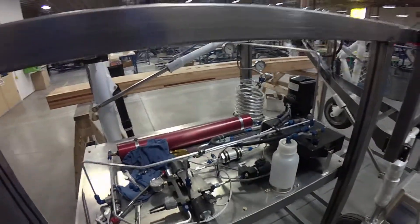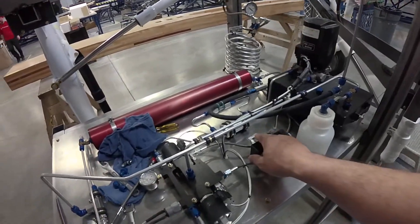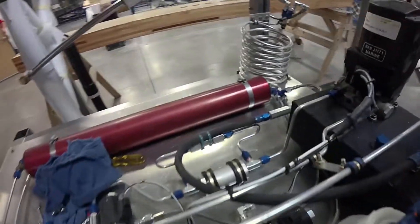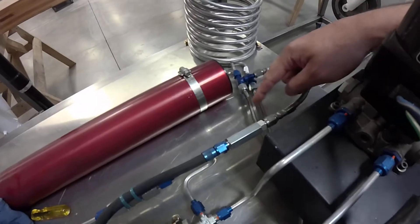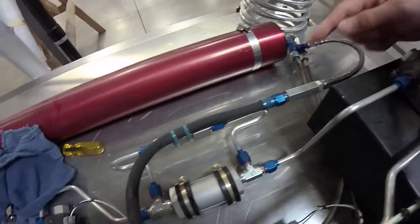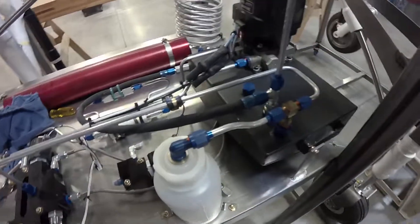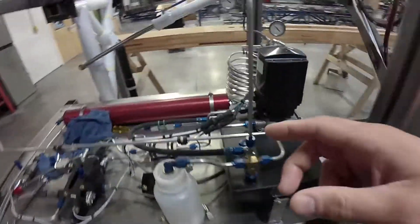We're at the evolution gear test table. I have removed the service bulletin, capped it off, and now got my line directly feeding. We do have the velocity valve — I have the high line right here for gear up, teed running into this one-way velocity valve, then going through and teed into the return. The return is where the dump valve dumps the gear.